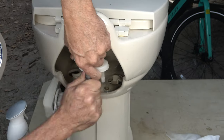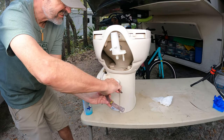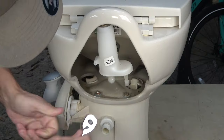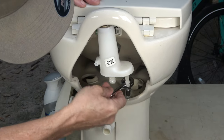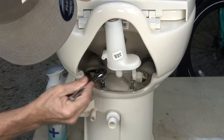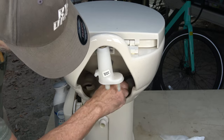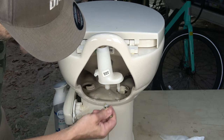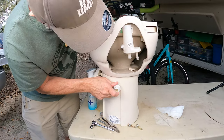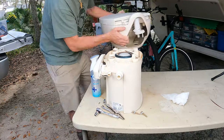Remove the upper and lower vacuum breaker hose clamps and remove the clear hose. This makes it easier to get at the bolts to separate the tank and allows for cleaning. I used a toothbrush to clean out the inside of this hose. With the vacuum breaker hose out of the way, it's a lot easier to gain access to the 3/8-inch bolts that hold the china bowl to the base. I used a 3/8-inch ratchet with a small handle to back out these bolts. Place the bolts aside, making sure you keep the metal washer and the plastic washer with each bolt. While holding down the base, rotate the china bowl counterclockwise to release the bowl from the four locking tabs, then lift off the bowl and set it down.